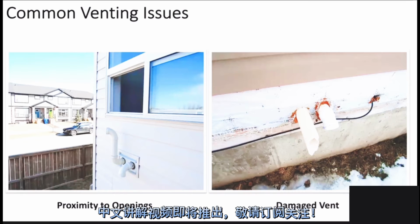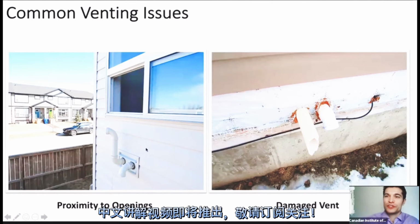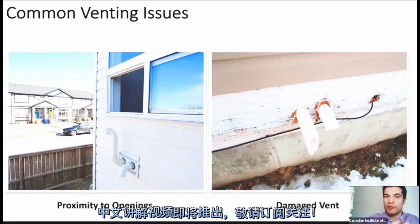That question that I asked you, the picture on the left is exactly what I'm talking about. The height from the top of that intake to the bottom of the other. Why is it so high there if it's not required to be 24 inches? Right, it's not that it's required to be 24 inches. It's just that some applications may allow for it. There are typically multiple different configurations that the manufacturer may allow for venting. Like the image on the right, you have two horizontal terminations here, and you have a periscope up.